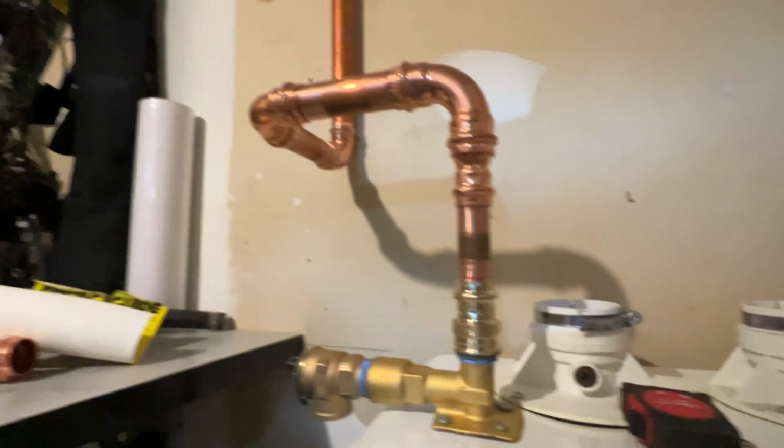And if you can reach that one up top, that's the hot water going to the house. Yep. And then you should be able to open up that bathroom back there, that hot water faucet, to purge some air out. Now we just have to work on the venting. We're just gonna go right there to that concentric kit.